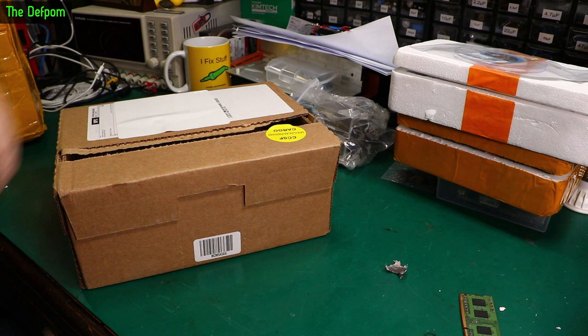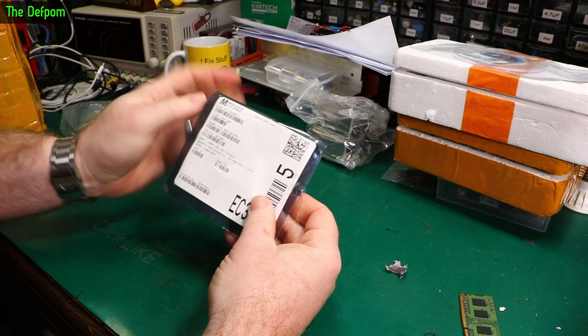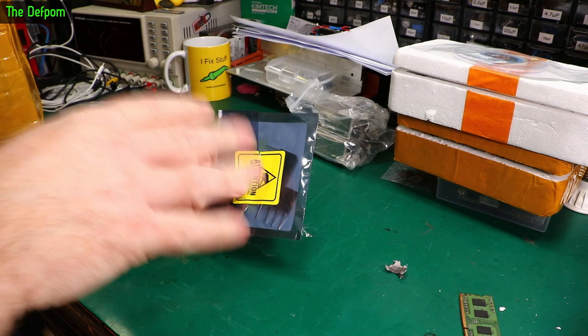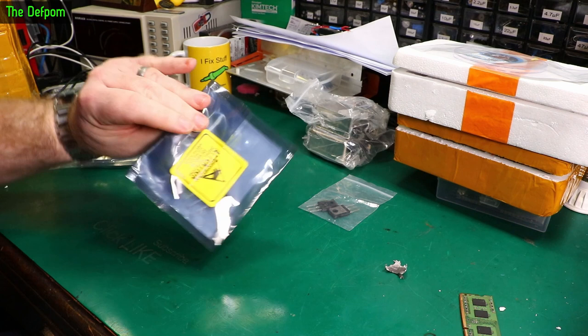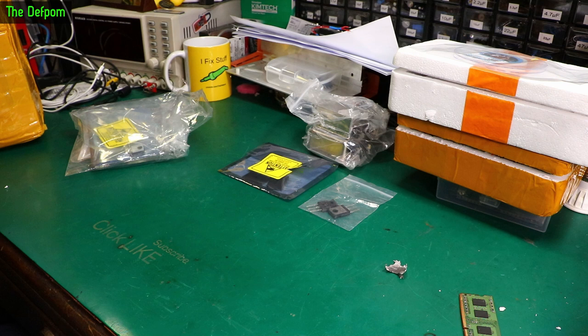This I think is from Mouser. It is. Big diode bridge - it's a GBJ25M diode bridge. I've got some of these because I'm suspicious about something I'm fixing. This device is giving a short circuit under high voltage. I'm pretty sure it isn't the bridge rectifier, but as I was buying some stuff from Mouser anyway and it didn't really add much to the cost, I bought some spares. These big bridge rectifiers - 25 amps. As Mehdi would say: big full bridge rectifiers.